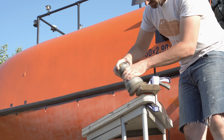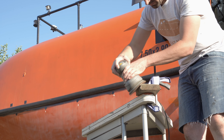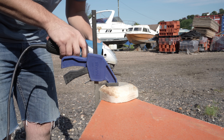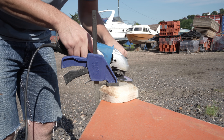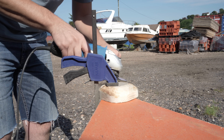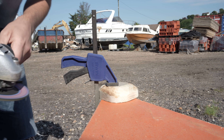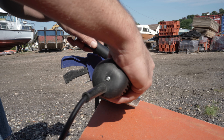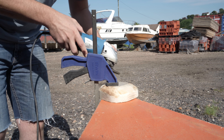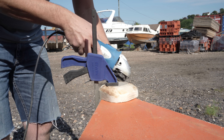So I took the corners off the 120mm square block so that I could work towards the circular shape. I've oversized the block in all dimensions, including thickness, so that the resulting fiberglass part can be cut back to various sizes. I'm baiting the 3D printing evangelist here, as with absolute certainty, a pattern with perfect uniformity could have been programmed and printed to create the sort of very shallow dome shape I'm after.